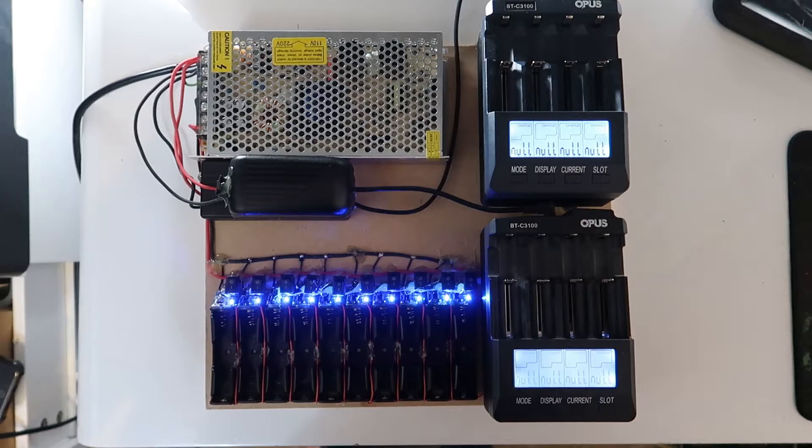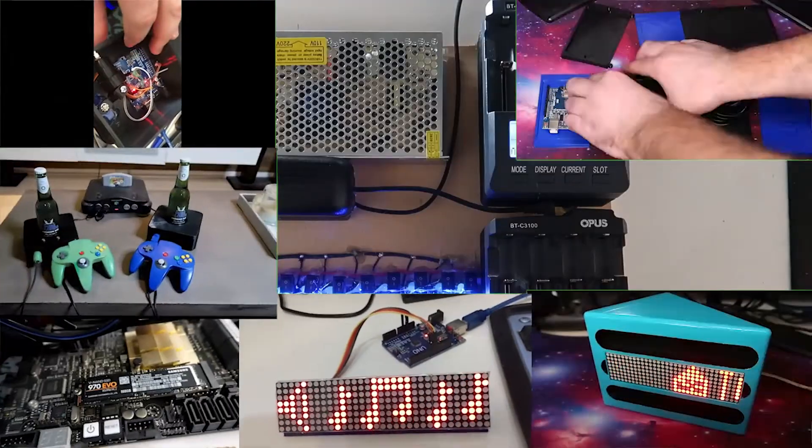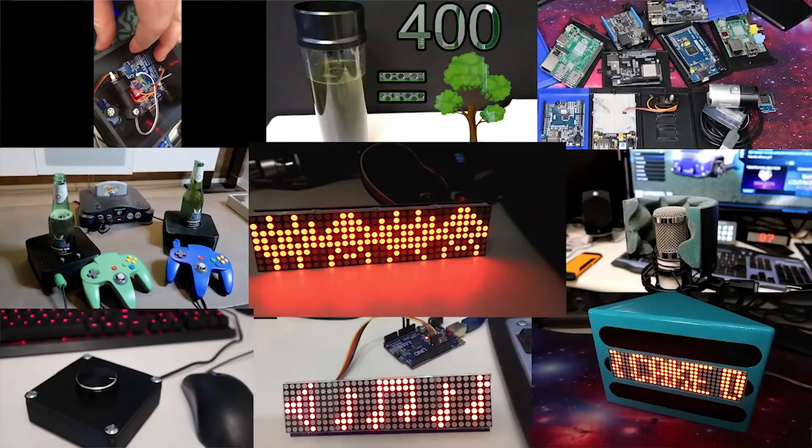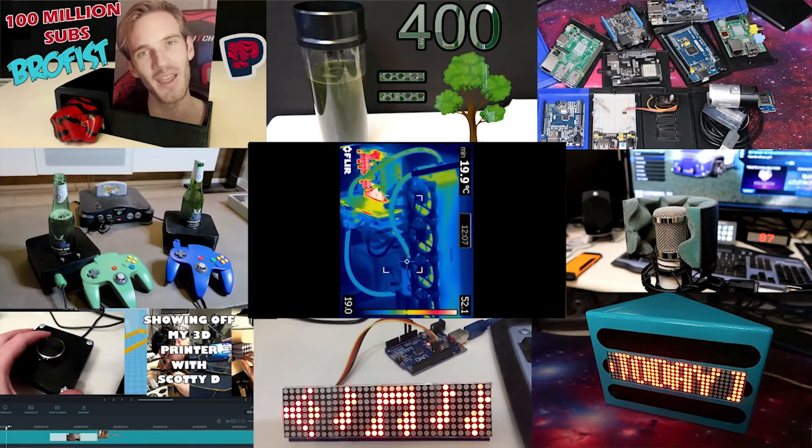That wouldn't have happened if there was a little bit of spacing, and because everything moved it broke some of those connections for the power going into the actual charging board. When I redo this I'll fix up the spacing between those cell holders and fix up the actual switches so they're not directly soldered onto the board. It's quite easy to fix up and make into something suitable. I've got the chargers and the Opus units which do the discharge tests, so now I've got quite a good size testing station for my 18650 cells. I'm going to do some future projects on battery cells, so make sure you like and subscribe to keep up to date. Thanks for watching and we'll see you next time.